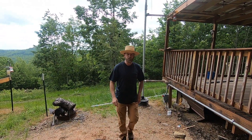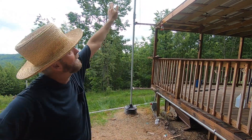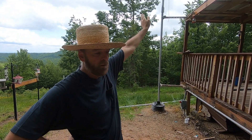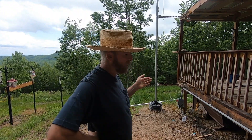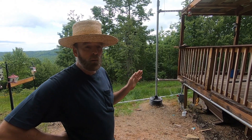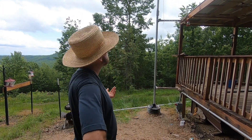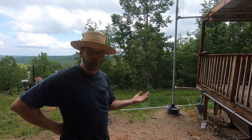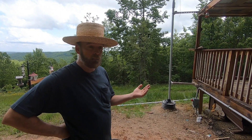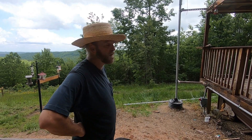We'll turn the camera back on with that owl tail. Of course the camera and Murphy's Law are kicking in — we turn the camera on and everything stops. It's already tracking 100% better. It's already wanting to turn. It's moving. I haven't checked the amp meter yet for power, but my main goal was to put that tail on. And I figured while I had the turbine down, I'd also go ahead and update the PMA on it. It seems like it's quieter — I don't know if that other PMA had a grinding bearing in it. I just know it's running quieter.